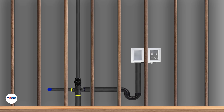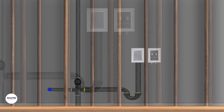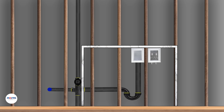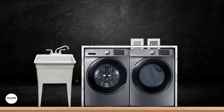The first thing to look at is the height of the laundry box. The maximum height of the laundry box cannot exceed 40 inches from the finished floor. Because the height of the washer and dryer is 41 inches, the counter starts after that. So if the box is higher than 40 inches, you're going to end up with the box visible behind the laundry, which isn't the best look.